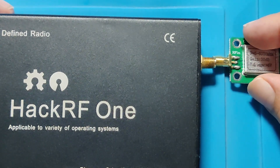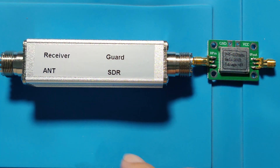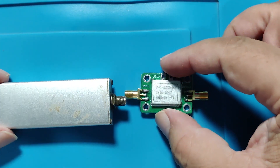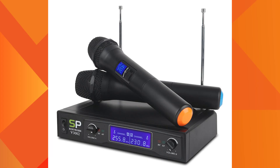We can also use it with an SDR. For receiver protection, use it after the SDR guard; otherwise it can be destroyed by lightning, high static charge, etc. It can also be used to improve the TX power of an FM microphone, which will increase its range. We can also use it with wireless microphones, however it is tricky because there is no antenna connector or space available to fit it into the mic.